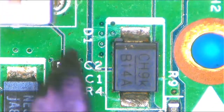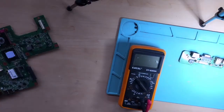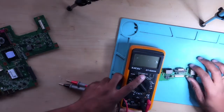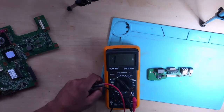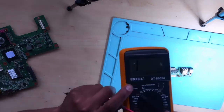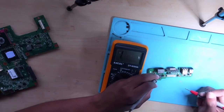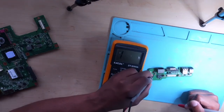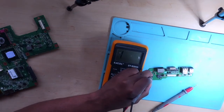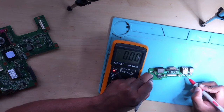Let's go ahead and check for shorts. How do you check for shorts? Simple — you need a multimeter. Turn on your multimeter, make sure it's on continuity mode. Then take one probe and connect it to a screw hole or on top of the USB connectors — the screw hole is much easier. Let me show you right now.